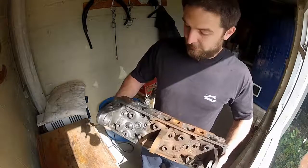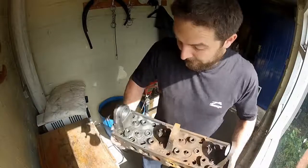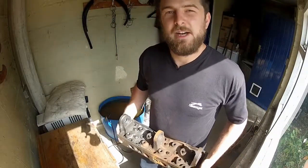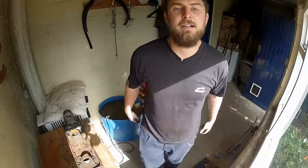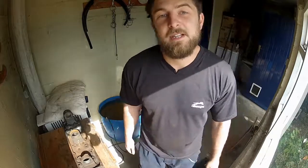So that's electrolysis. I'm hoping the camera's good enough to pick that out. If you want it to stay like this, you must immediately dry it off and then cover it in a light film of oil to stop it re-oxidising. But essentially that's it — thanks for watching and I hope this helps somebody out.